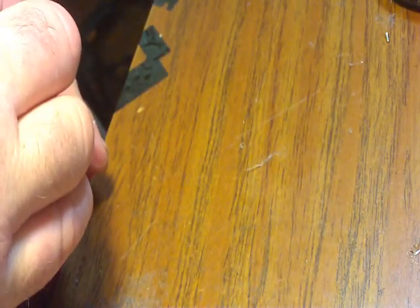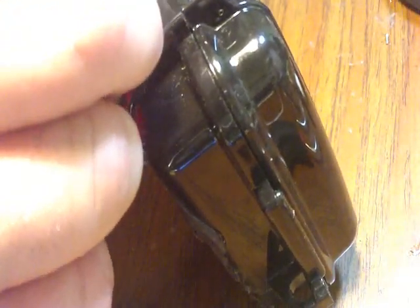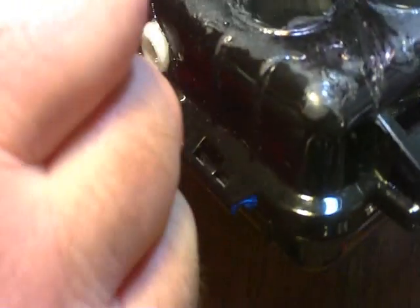It's a little bit messy. I like to make sure that my pipe seals — if it doesn't seal, it can leak there. You also don't want your pipe fitting so tight that it distorts the case. The pipe fitting cannot distort the case or it will leak. So I have it where I want it, and I'll get my goop in here. Make sure we get it all the way around so it can't leak anywhere.